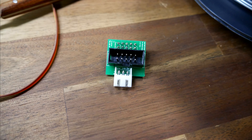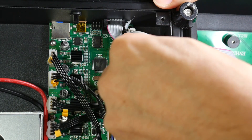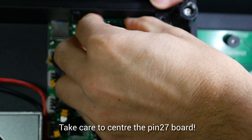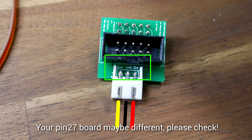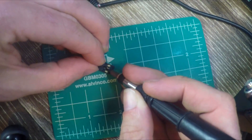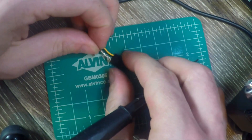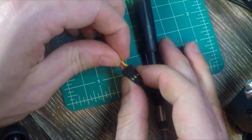For this guide, I'm going to be using a pin 27 board, which means you don't need to cut any wiring. There are links for these from a range of countries in the description. Like the other connectors, there's a little bit of hot glue to pry off so you can pull out the ribbon cable plug — just be sure to support the main board while you do. The pin 27 board plugs right back into that slot, but be careful to have it centered as it's easy to misalign two of the pins. The ribbon cable plugs right on top of that. There are variations in pin 27 boards, so please read the wiring diagram on yours and wire your plug accordingly for the BLTouch. This is a Dupont connector and by lifting the little tab, you can remove the individual wires, change the orientation, and plug them back in. I needed to swap two of them to get everything to match my pin 27 board. Make sure the little tabs are pushed down so they don't come loose.